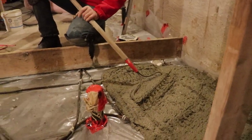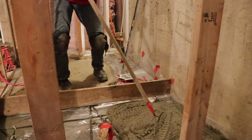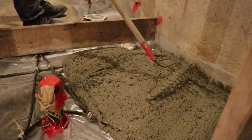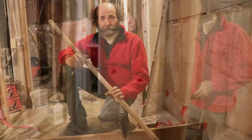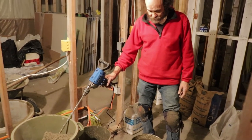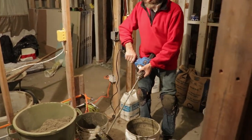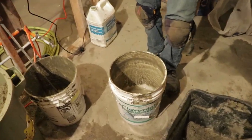The consistency of the cement should not be very hard and not too soft — just a nice workable mix. If you feel comfortable working with it a little softer, that's okay too, because water doesn't damage the cement. For this one we're using a drill with a paddle to mix it up at the bottom. It's a small job so we don't have a concrete mixer — we just mix it by hand with a drill. It's less mess and doesn't take much time. This is how the subfloor looks in different spots when you finish.